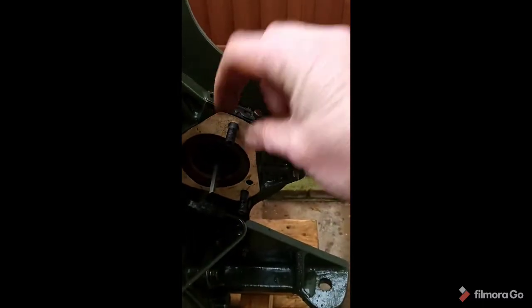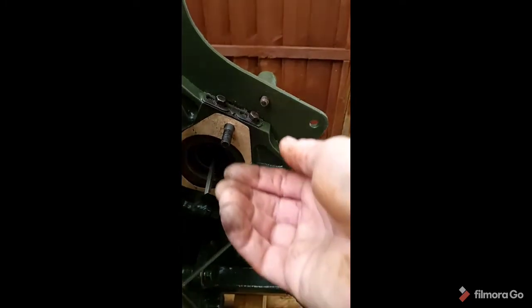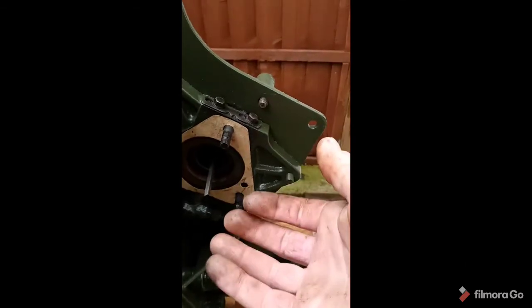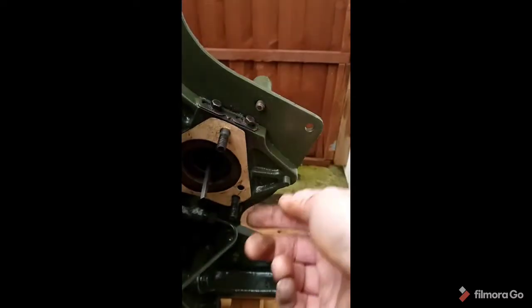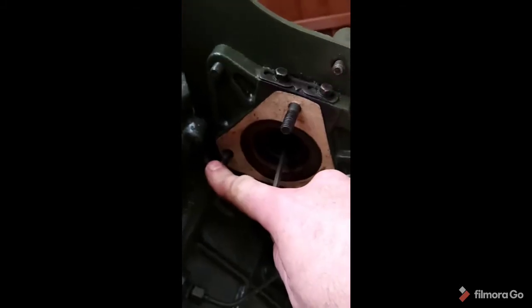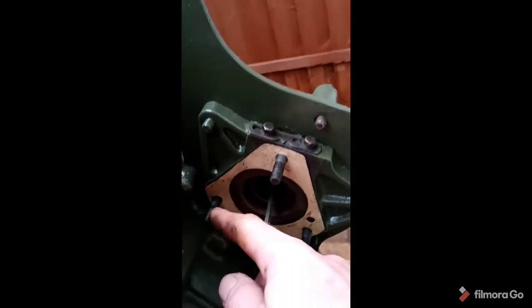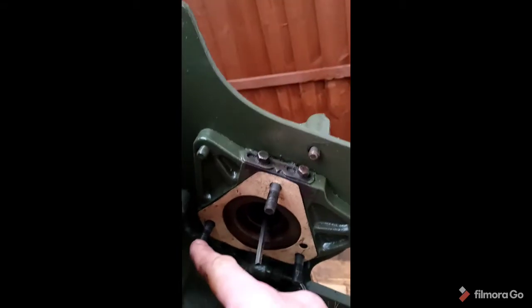Now the holes, the actual bolt holes on the injection pump are widened or extended, so that gives you a bit more play. And then what we're looking at doing is guiding that over. Okay, it's going to take a bit of twist, a bit of pressure, guide that pump on, okay, and get it sitting on the studs. And once that's done, we can get some washers and nuts on there. The rear one being the nightmare child, just down here. Okay, but we're going to try and get those on. Now, you're not going to want to force it all the way on, because then you'll never get this bolt on. So we just want to get it sitting on that torsion bar, okay, with enough room to wiggle the washer and nut in on this side.